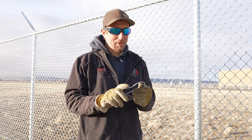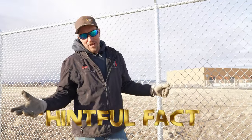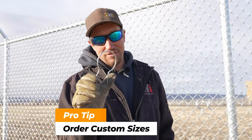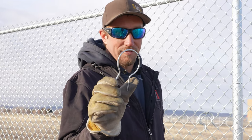One, you can get them in a tee post. Number two, you can get them in various pipe sizes. Also, hintful fact — if you reach out to us and you're in need of some, you can have them made to a custom size. The standard sizes are inch and three-eighths, inch and five-eighths, inch and seven-eighths, two and three-eighths, two and seven-eighths, and four-inch. If you have a custom size and you're in need of a lot of them, they can be made.